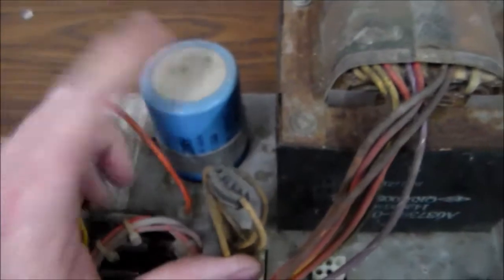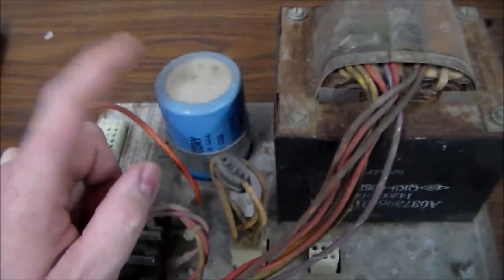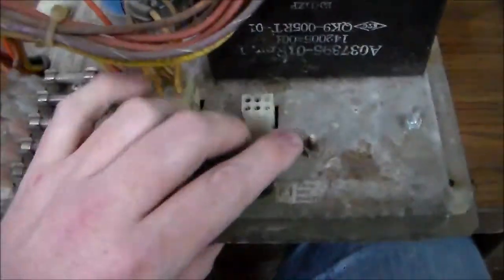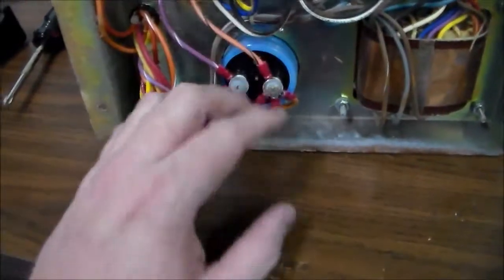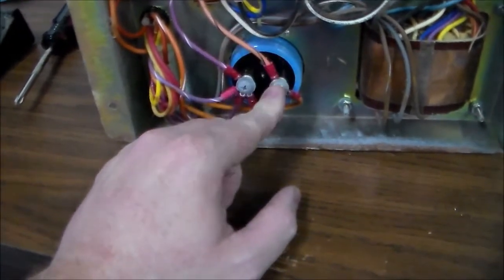The main thing that is usually necessary is this — called the 'big blue,' the famous big blue capacitor found in the bottom of all Atari games. It's used to filter one of the voltages — the voltage that ultimately becomes the 5 volts that runs the game board. There's a bridge rectifier that turns it into DC. These caps go bad over time, and they're really old now.